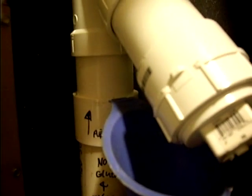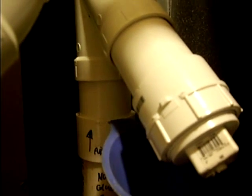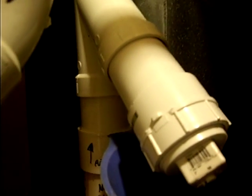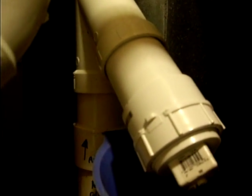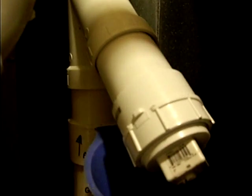I have a drain-out plug there so you could knock out an ice block that would fill up. What happens is the moisture goes up into the attic, and the attic is just open space up there. It's really cold, it freezes in the pipe, and then your furnace doesn't work because it's clogged — it needs that pipe open to vent the air out.